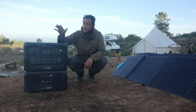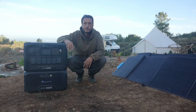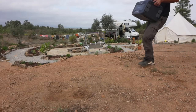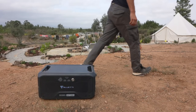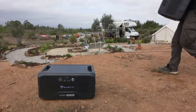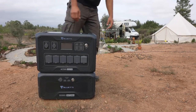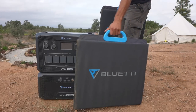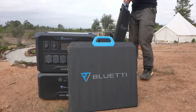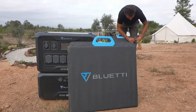Today we're going to look at this portable home backup power station and test it on a variety of different tools and equipment we use daily on the farm. In short, this power station is a rechargeable battery-powered generator that converts sunlight into electricity and stores the energy in the battery. The system we're testing is a Bluetti AC500 5000-watt inverter combined with a 3072 watt-hour B300s battery and four 200-watt portable foldable solar panels.